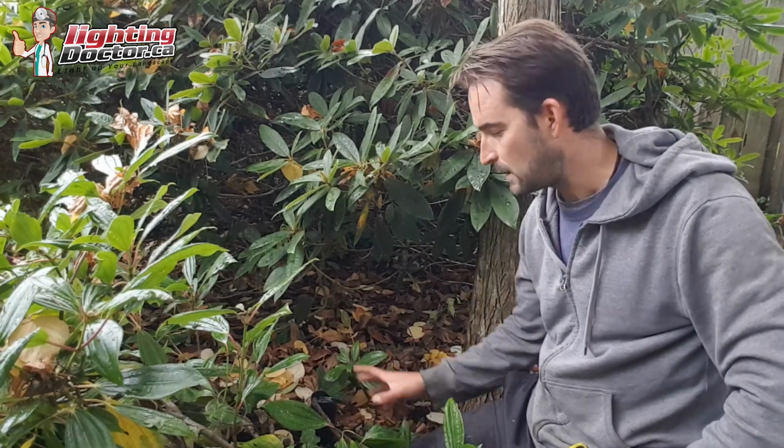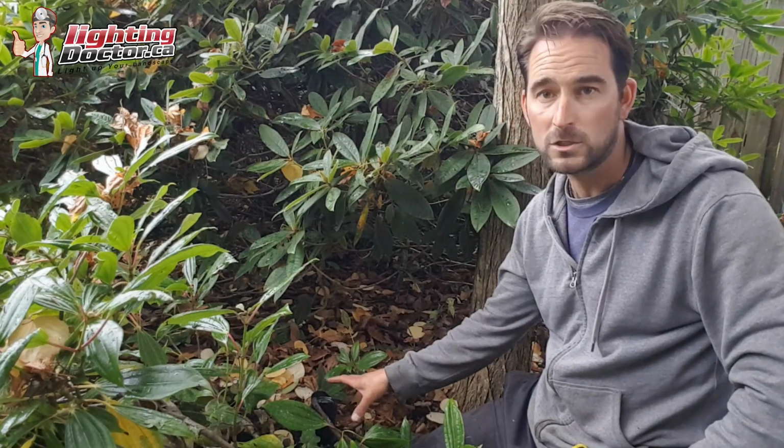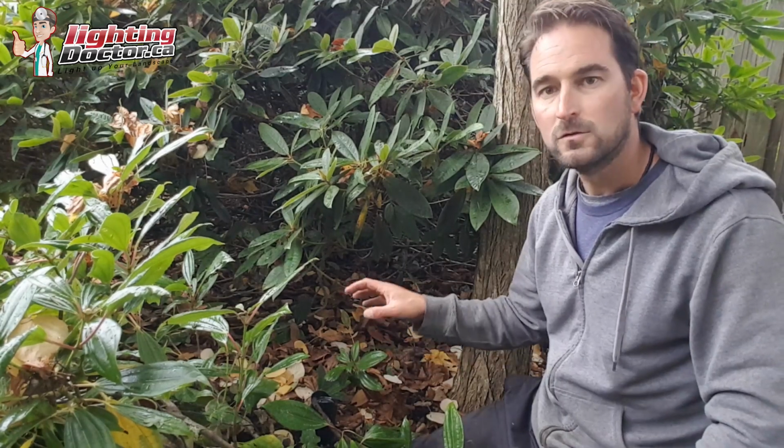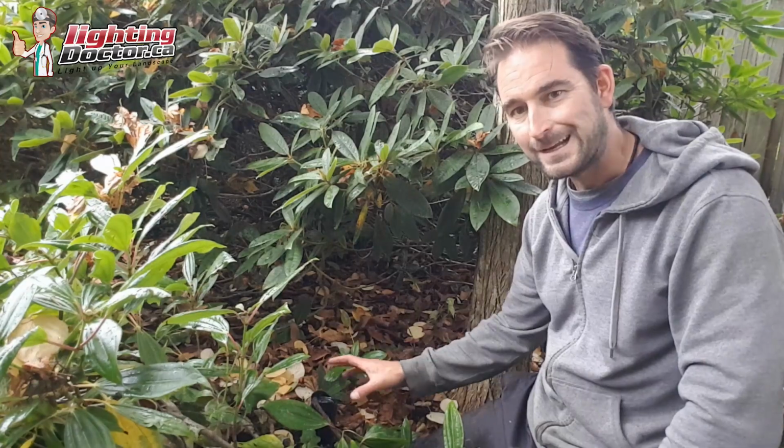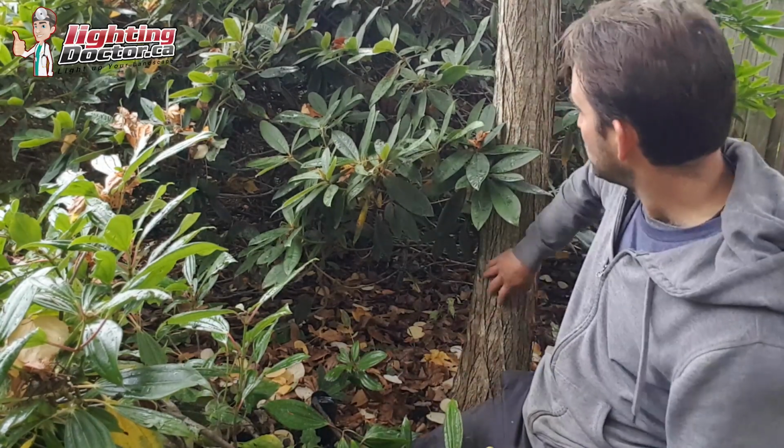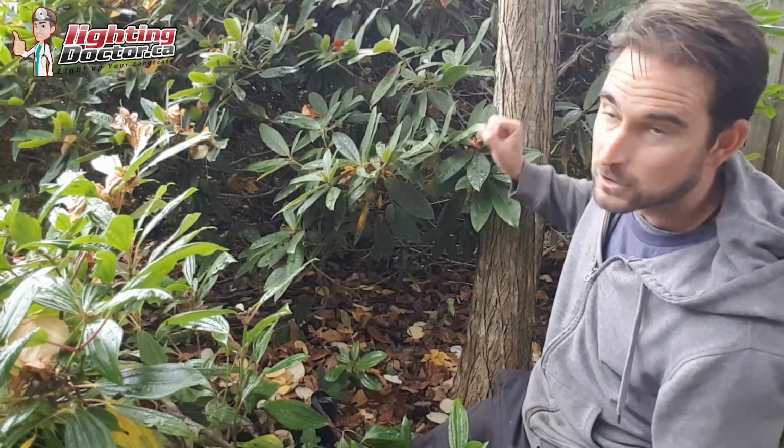I just want to show you, we're going to use our accent light a whole bunch in this property. And a lot of common areas we're going to use that is on some nice trees. We got a really nice tree here that we're going to try and focus on. But one thing I see people do too often is instead of trying to get that light nice and close to the tree and having it shine up, so you're taking advantage of all the bark structure and all the branching up top, they'll bring it far back and try and aim it at the tree. And what happens there is they tend to miss a lot of the lower portions of the trees.